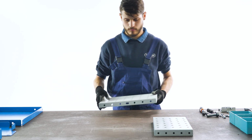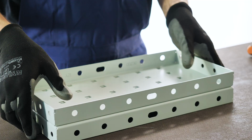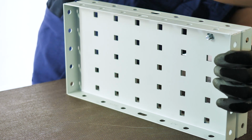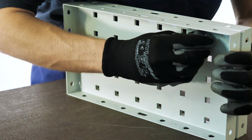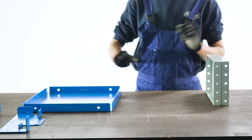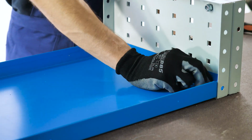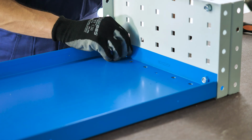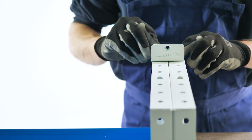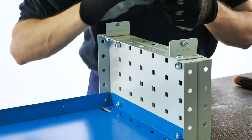Now we move on to pre-assemble any elements that need to be prepared prior to installation in the load-bearing structure. Let's start with the open shelf with case adapters, installed using intermediate side panels, arranged back to back and fixed in place by screws. First, fix the open shelf to the bottom of the side panels with 2 screws. Use 2 ABC 00005 reinforcement brackets to fix the 2 side panels to the horizontal profiles above.